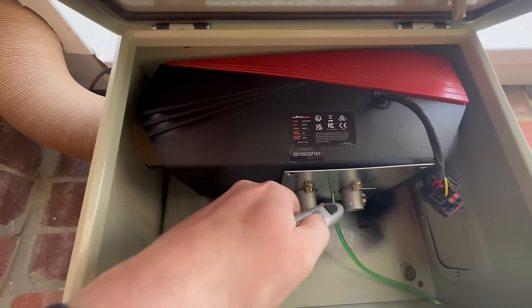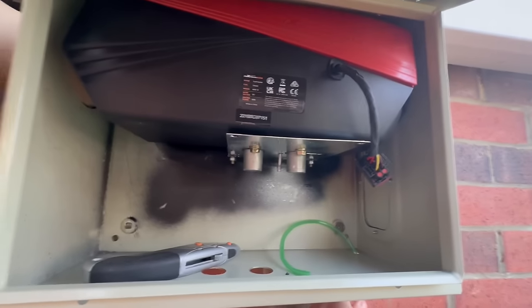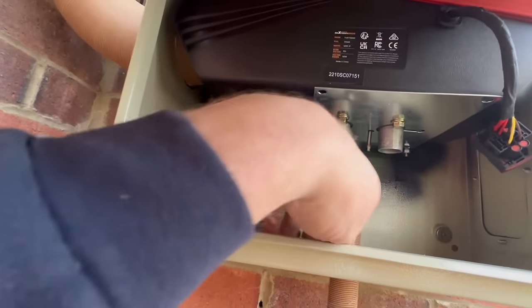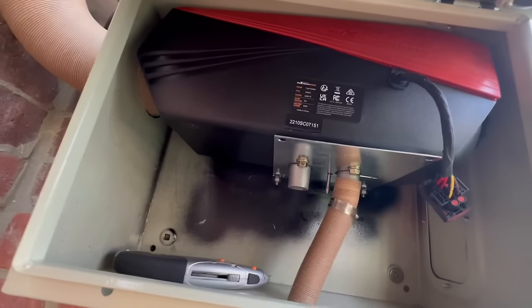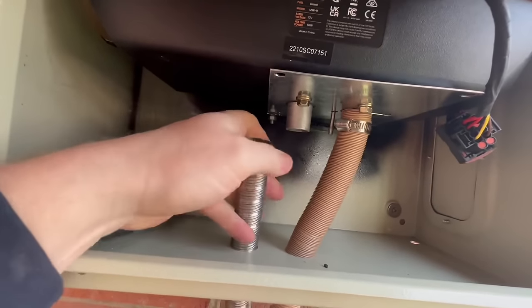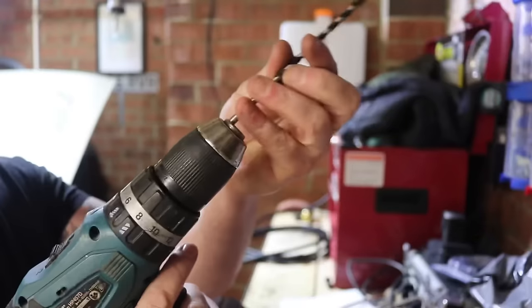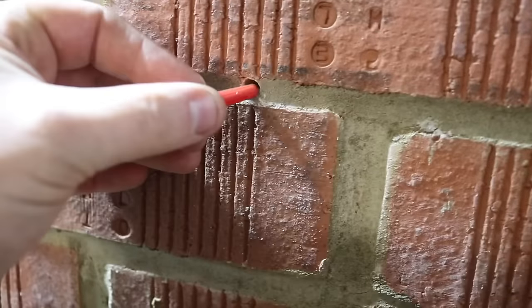So we've got it on the wall. I did try the fuel line that came with it and it's absolute garbage, so I'm going to put that off and I've got some new stuff to go on. I'll cut that off there. Next we'll fit the inlet. The next job is to drill a hole and mount the fuel pump at an angle between 30 and 45 degrees.